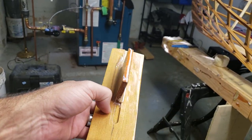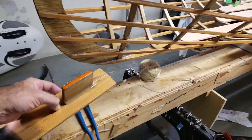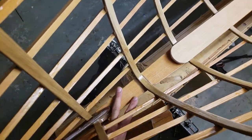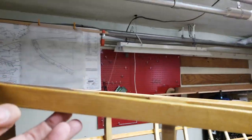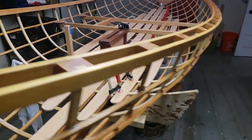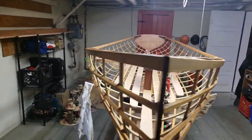There's a little routed recess in the keelson where it comes into the bow stem — I was able to align this on center to sort out the taper and tie everything together. All the structure in the bow and underneath the breast hook is all thickened epoxy, and there isn't a single fastener in this boat at this time. That's the frame — I just changed the epoxies to something I was used to.